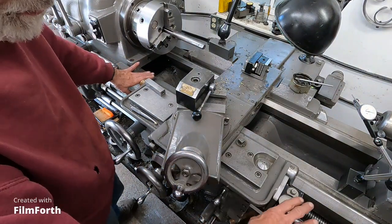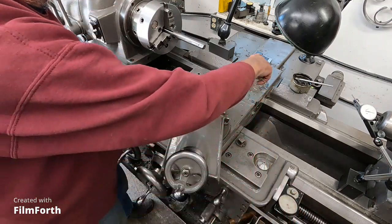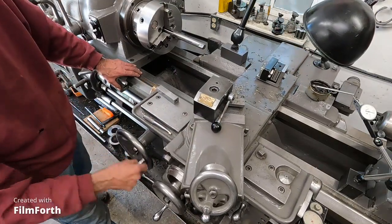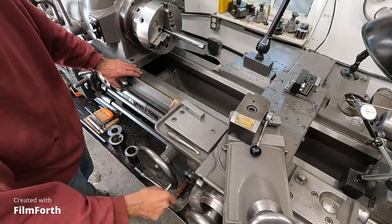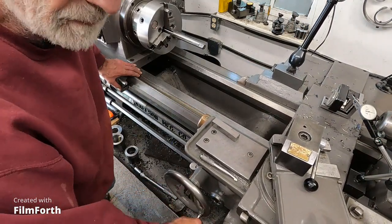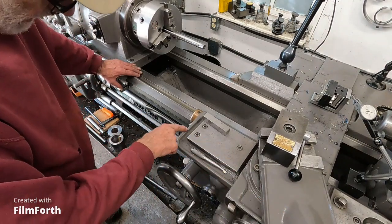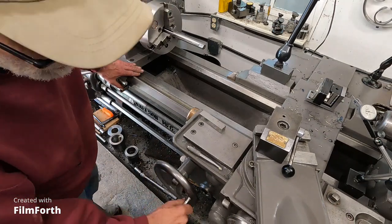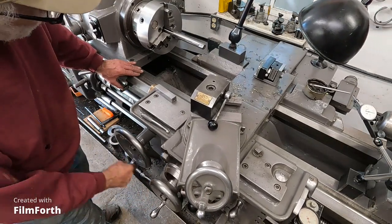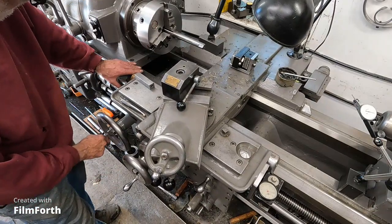And the first thing you do, get this thing at 2 degrees, load it so the spring's in the right position in the window, you have the right tension against the ways. Then you run it back and forth several times. Several times. And what that does is it gets a little micro track etched into the side of your way there, because that wheel is really hard, that's in this Trav-A-Dial.